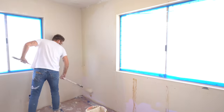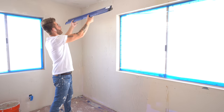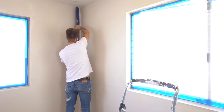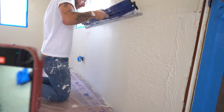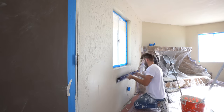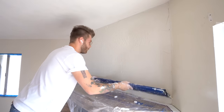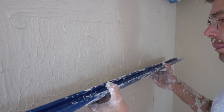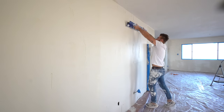I picked up a very cool tool online — a 48 inch skimming blade. This is going to give me a really wide reference surface, and I'll leave a link below. A 48 inch wide blade means it's the same width as a standard sheet of drywall, so if there is a dip or a raise in any panel, I could theoretically go stud to stud or edge to edge and flatten it out. I found I was getting a little more negative space or voids when I used this than a drywall knife, because I built a thicker first coat. That wide reference surface prevented me from digging in and removing as much material per pass. My first impressions are really great, and we'll come back with a second coat to fill in all of those voids.